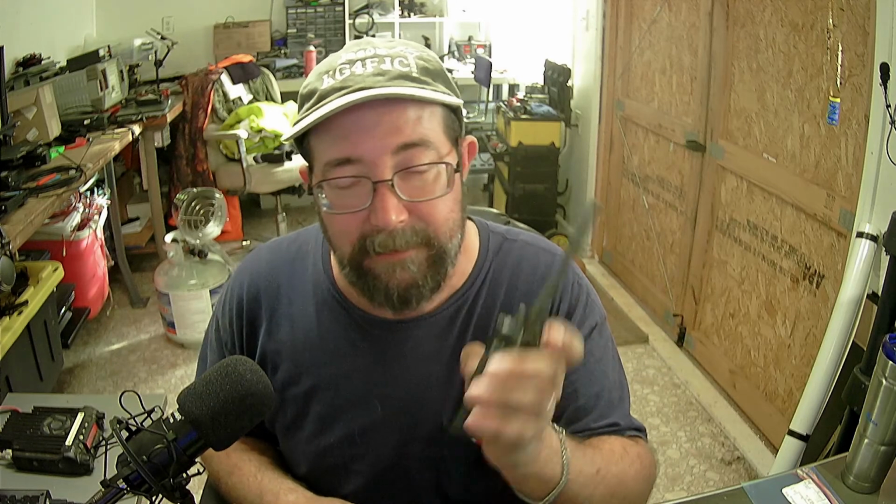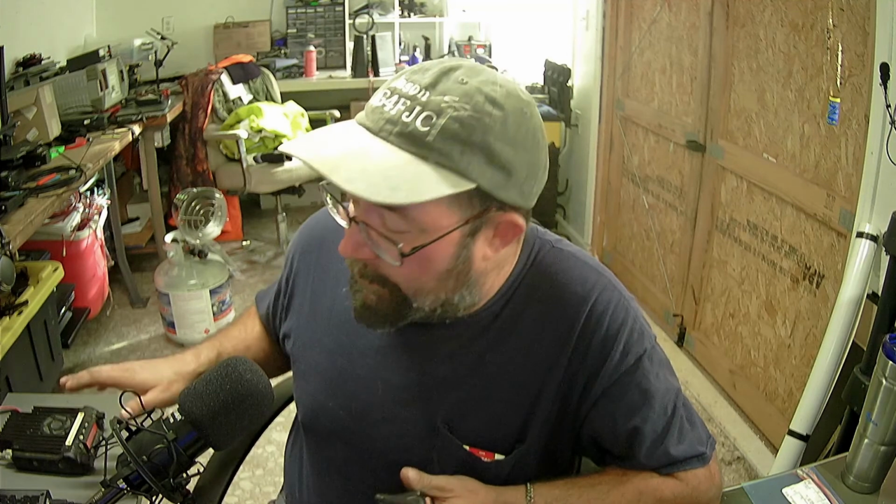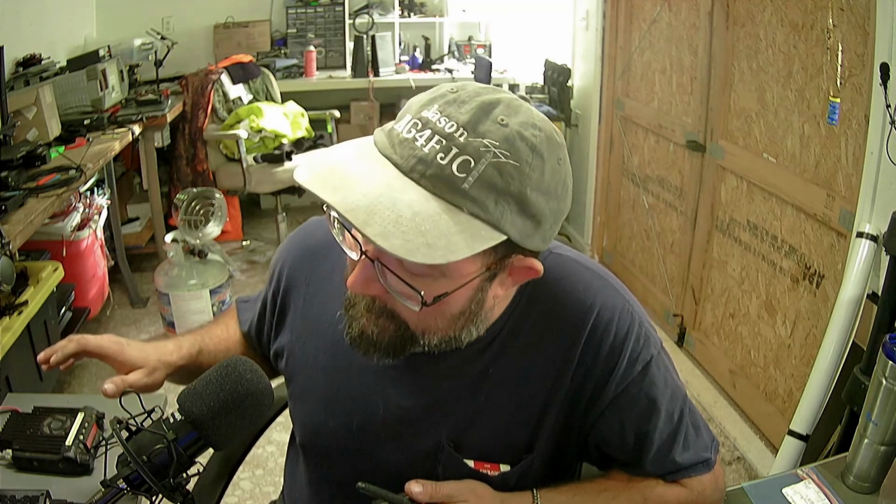And we should also have Mr. Potato Fang, as Christian down here in Gloucester calls it, Potato Fang. I like that. Set your TYT up on a simplex frequency. I'm using 2235 because I'm on a dummy load, and I'm using a Baofeng because it's a piece of crap. So turn on your radio. It should not start transmitting. If it does, I'll show you where we change that. If it starts transmitting, turn it back off. But it should not.